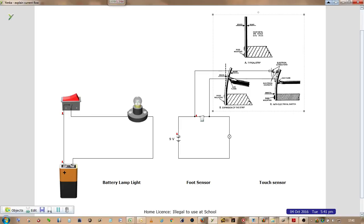If you put it somewhere here, it will retract away for a shorter distance. You loosen a screw, it retracts even more. Basically you are adjusting how close it will be between the two contacts, and that adjusts the temperature of the device you're trying to control. If this touches there, a light will go on, and we can call it a heat sensor.